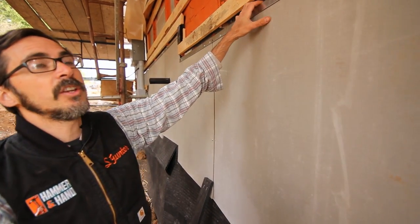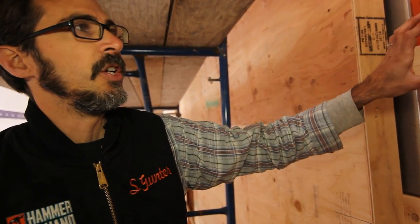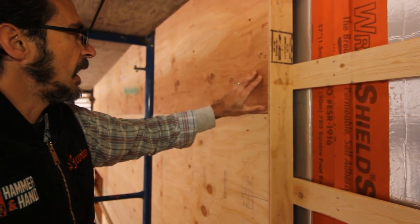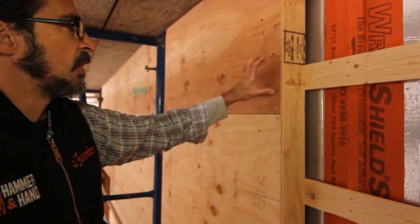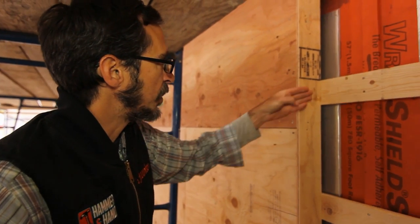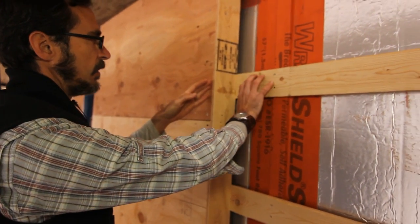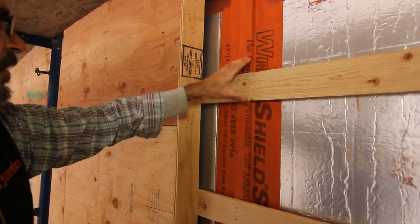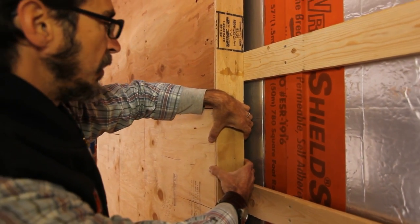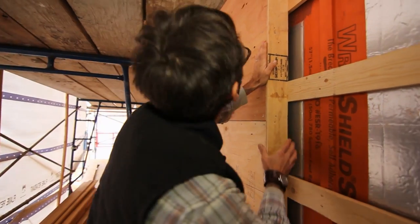That's all the components in this exterior drainage plane. Another interesting aspect on the building envelope is we're using two different materials: a vertically oriented cedar siding here, and an exterior grade plaster — it's pure lime plaster — after two layers of 60-minute paper, the plaster comes out and returns back. This is the interface between the plaster and the wood siding. The whole thing is back vented, so this is a little thicker — it's purely an architectural detail. It returns back in and there'll be a little shadow line.